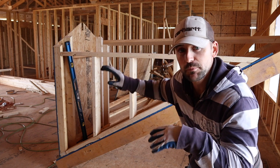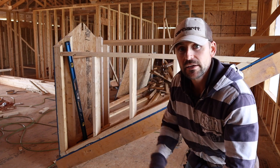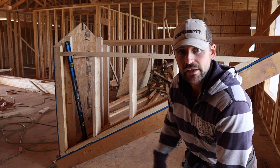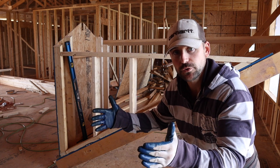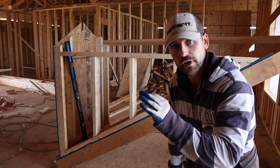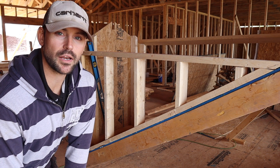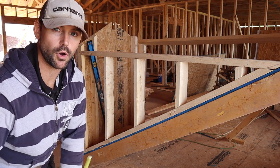Just like the video yesterday, I'm not going to nail any of this together because I'm going to use it as a template to make my other walls — they all get the same framing. The sheathing just gets nailed on one side or the other depending on whether it's the left or right side of the dormer. Now that I've got my templates done, I'm going to go through and cut a big batch. To cut the sheathing, just measure the height from the top plate to the bottom plate at the beginning of the wall.